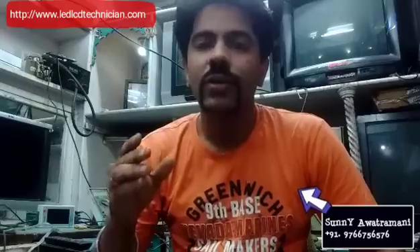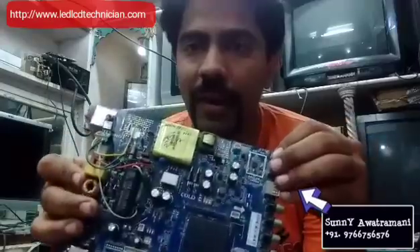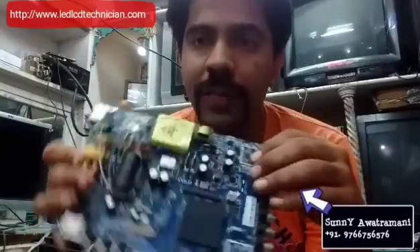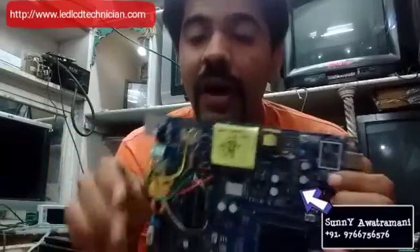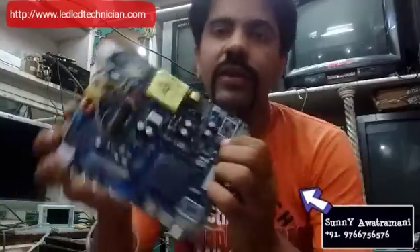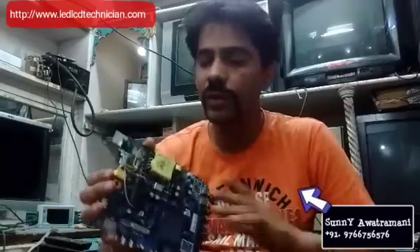What is this video? I have a board called CV-338-H-A42. I had a problem with the power supply. After the repair, I used a model called DMO465. After replacing the DMO465, the power supply came on successfully. It is a 40-inch TV.